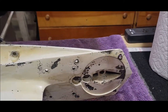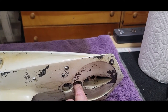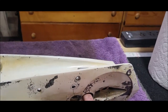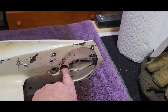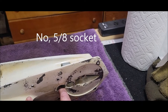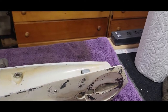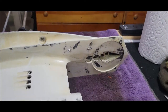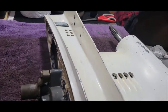You've got to take the trim tab off to get to one of the bolts. Leave that one in — it just holds the anode or whatever that is. This one is bigger, I think 11/16, while the others across here are 9/16. They tell me I'm going to take this unit as-is down to the boat store.